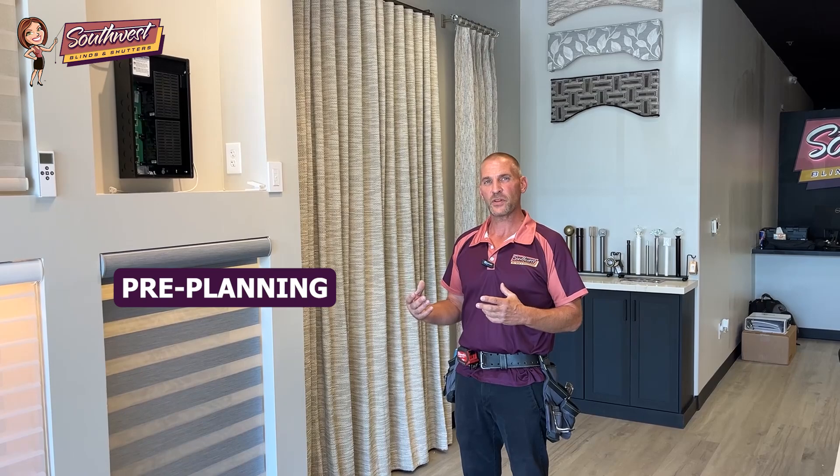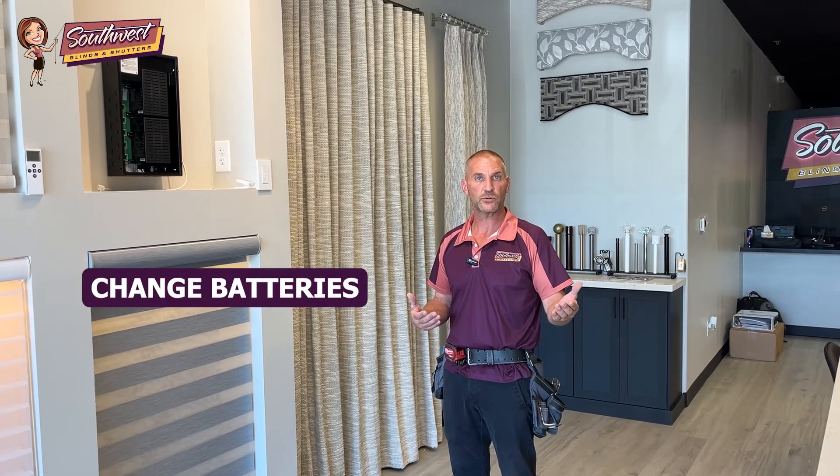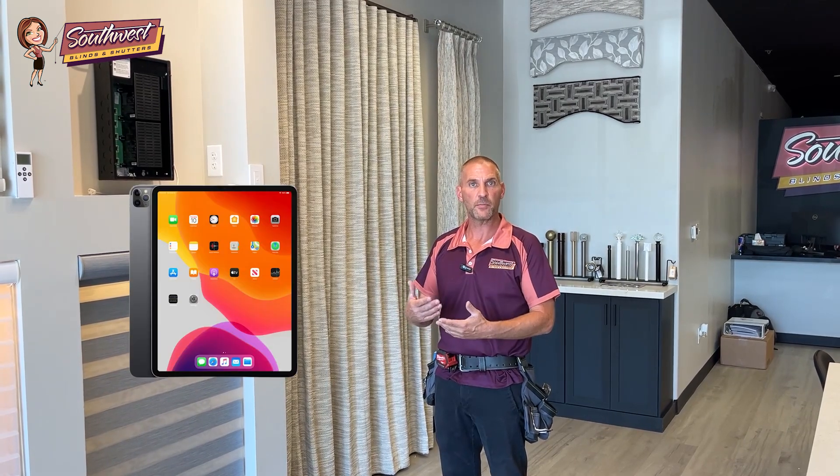The big thing in the beginning is the pre-planning. When we're constructing a home, we think about the processes as they lay. We dig the foundation, pour the footers, do the stick framing — and at no point do most people think about shade applications when all the drywall is up. With home automation now being such a big thing, a lot of people are wiring their homes so they can have their shades in home automation. Through low-voltage cable, they can send power but also send a data signal back to the power panel, which loops into home automation and gives access from anywhere in the world through an iPad or a wall switch.